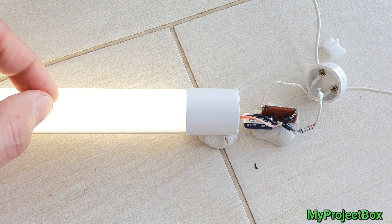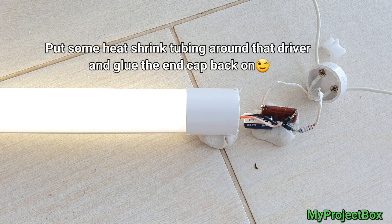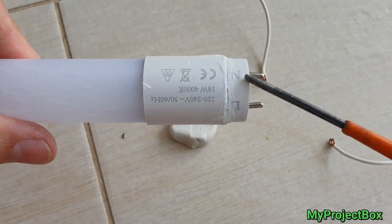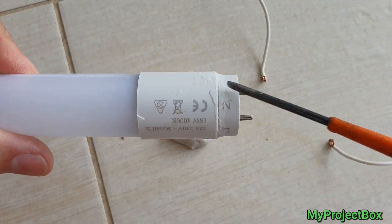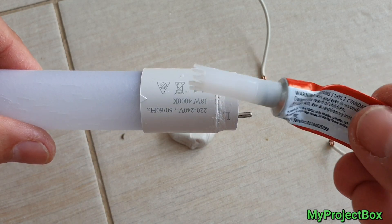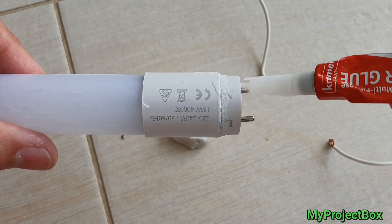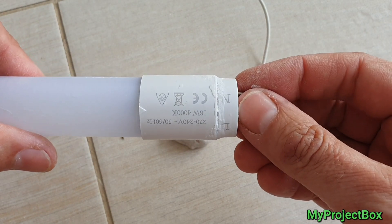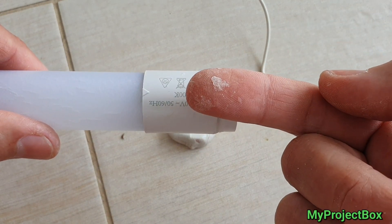It's quite a crappy one with this really brittle plastic, but if we glue it back together we'll have a working LED tube which hopefully runs at a slightly lower current so it's not roasting the LEDs as much, so it should last longer than it did originally. It's all glued back together — it ain't pretty, but it's definitely going to work, and it's going to be behind the diffuser anyway. I use my favorite trick: a bit of super glue, and then to accelerate and bind it together, use some bicarbonate of soda — just sprinkle it on top of the super glue and it sets instantly, so you don't have to hold your fingers there for ages.